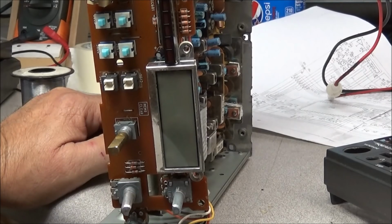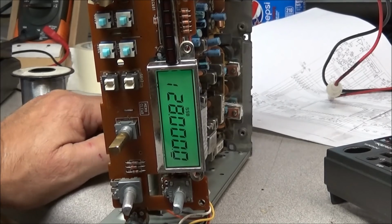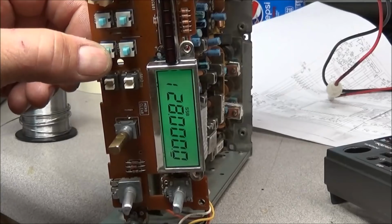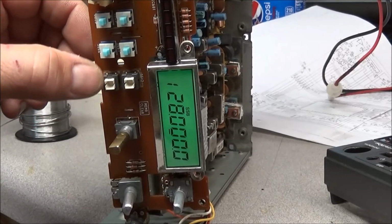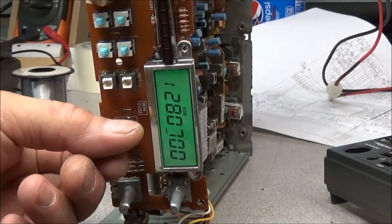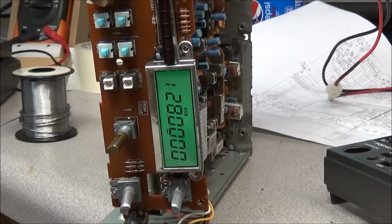After checking the voltage on pin 41, I turned the radio around. Just wanted to check something else and looked, and this is what I see. No flashing of the display. Span button moves up and down. And the encoder is now working. So it looks like somewhere we either have a loose connection, or by testing the voltage on that pin, the CPU may have reset.